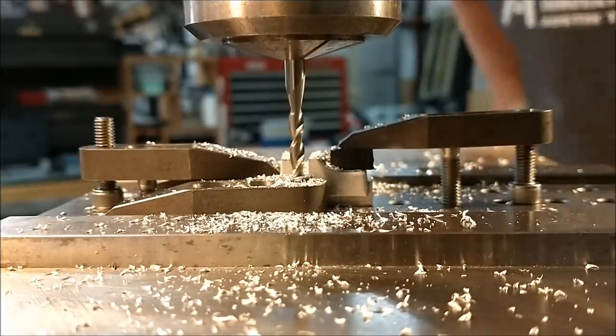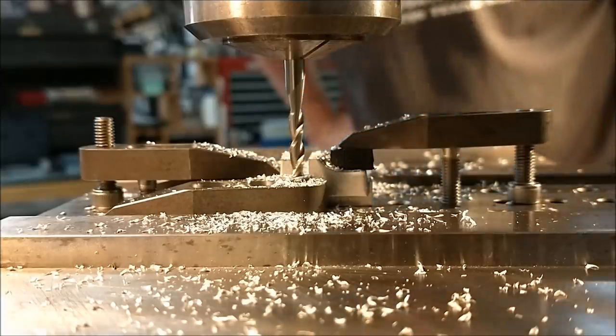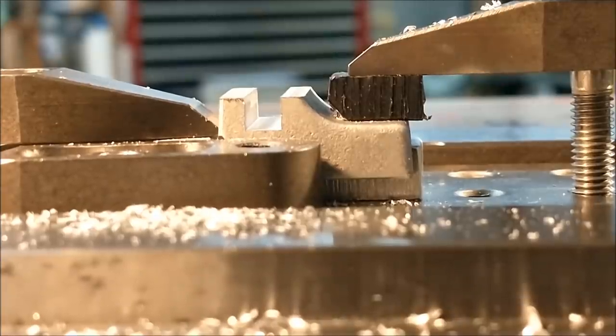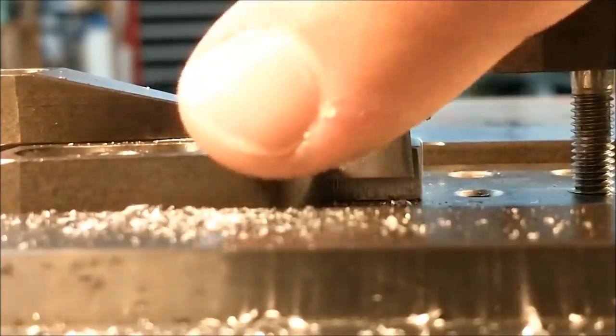I'm going to go get a gauge pin, make sure that is a .156 slot before I proceed. Using the same T-slot cutter as I used for the faceplate, I am going to register off the bottom of this slot, shift the cutter side to side .031. I guess it's about 0.8 millimeters, and we're going to end up with a .156 upper with a .188 lower. That is really small. Human finger. Woof.